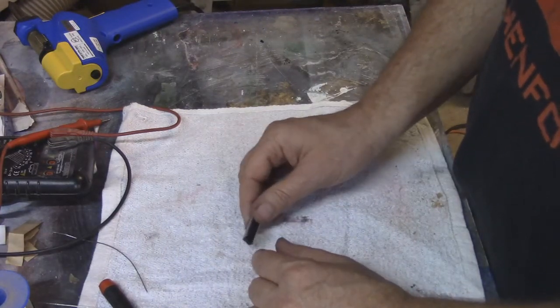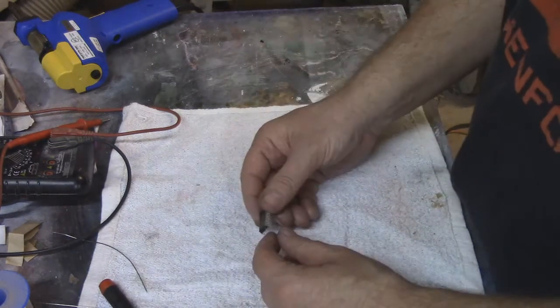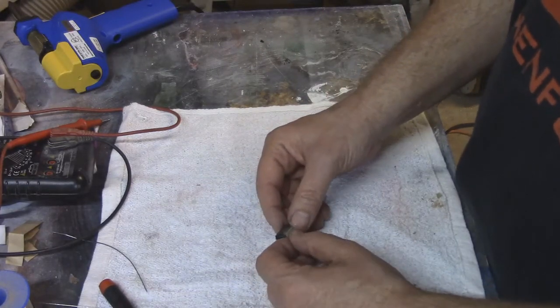I want to make sure that I can see solder go all the way around this. This is 4L, and 4L should only give us 8 tones this time, so we should only hear 8 tones when I put this back in. Let's turn it on and listen. So this RAM right here is bad, and it also tells us that the other RAM is good, because we're not getting 10 — now we're getting 8. And that's a good sign.